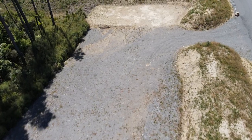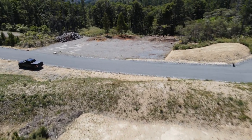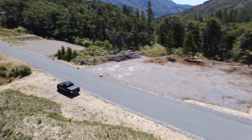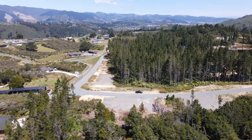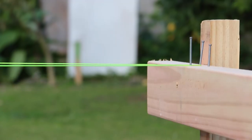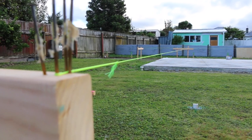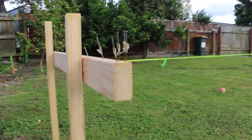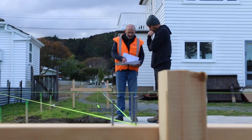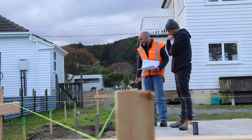One of the first inspections you'll have is what's called a siting inspection. A siting inspection is when they check that you're going to put the building in the right place. You get a surveyor to come and mark either the four corners or put some offset pegs in. We then put up string lines and use those to mark out the perimeter of the building. We also show the inspector that we've got the right height and the right size. It's really crazy to think that one of the first things we use as builders is string.